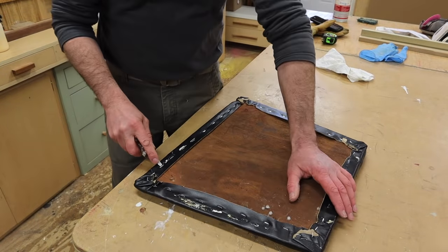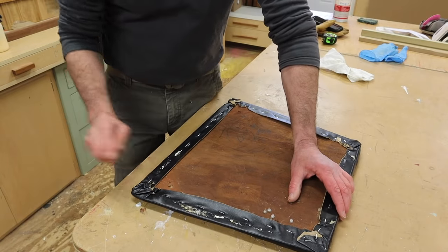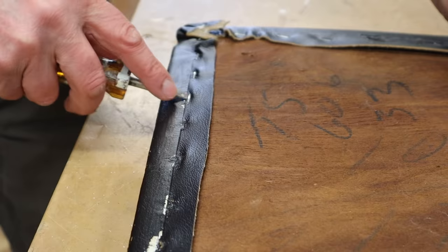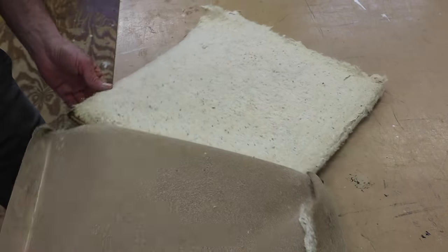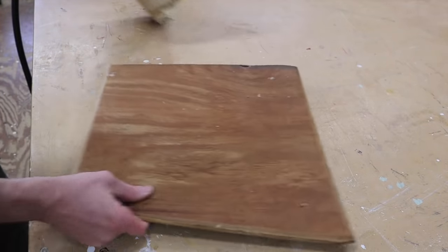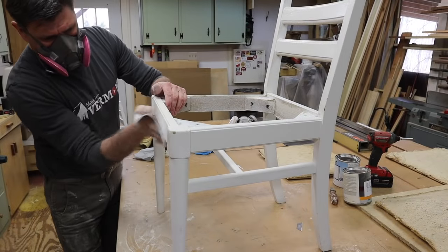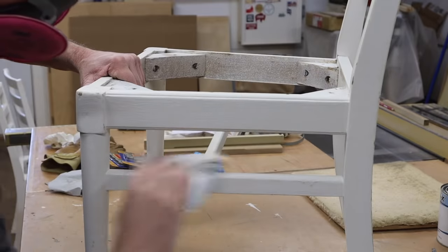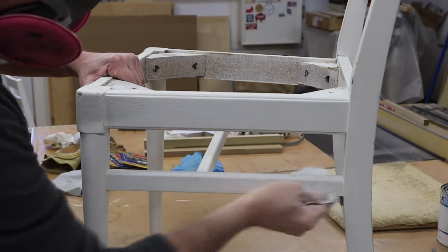While the chairs are drying off outside, I'll get started removing the old upholstery with a screwdriver. After allowing the chairs to dry, I'll give them all a quick sanding, only spending about 5 minutes each, sanding with 150 grit sandpaper.